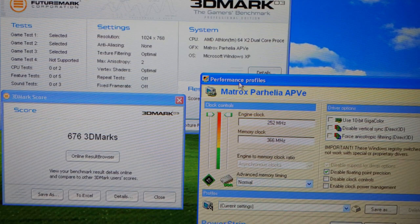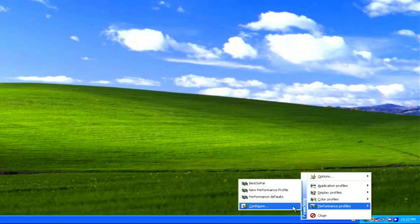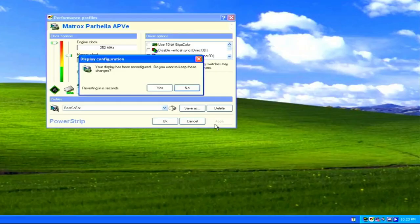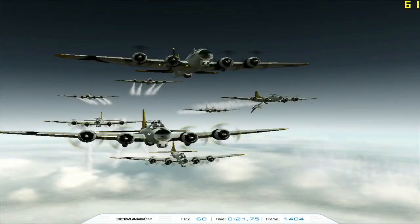Once the cooler was upgraded, I set to overclocking using PowerStrip version 3.9, the latest available. I went up in increments before settling on a safe and stable overclock on the core of 275 MHz and on the memory of 330 MHz. I could push both of these a little bit further, but I begin running into issues with either stability or weird graphical glitches, and I'd rather not run the card at the borderline for now. I think this overclock represents a pretty safe bet for what you could get out of one of these cards, so that's what we'll be sticking with for the remainder.